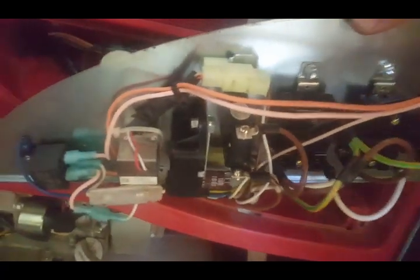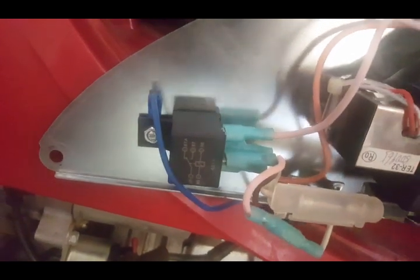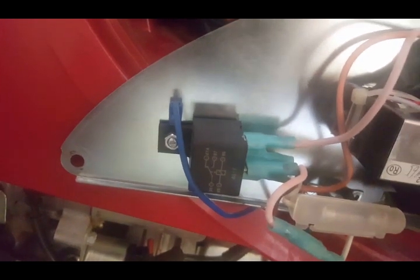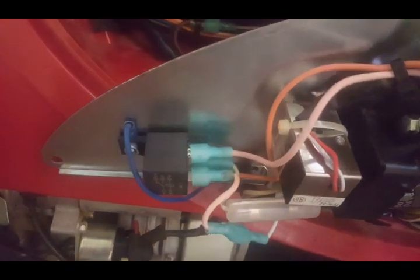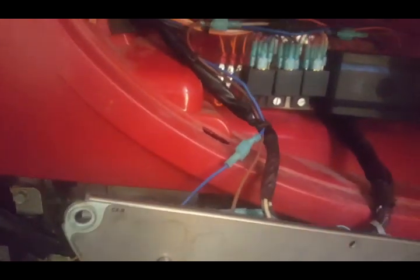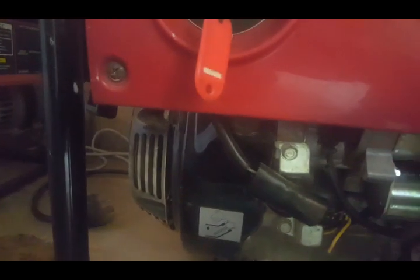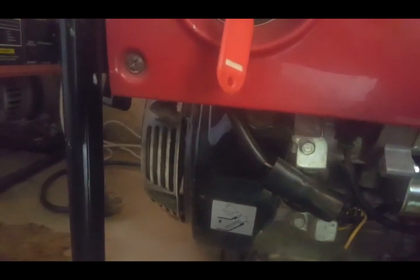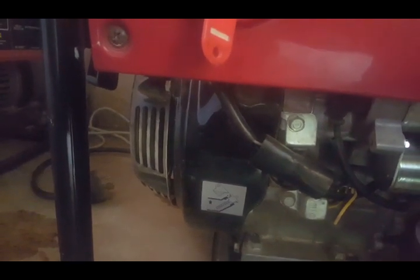It's the standard wiring. I did add one more relay, this relay here, which I included in the start circuit, and it's my safety device. Because if you press the start button while the engine's running, you have the horrible nasty effect of the solenoid pulling the starter motor into running gears, and it can bugger up the starter motor and the starter teeth that don't mesh into the ring gear.